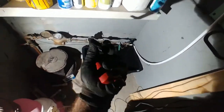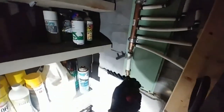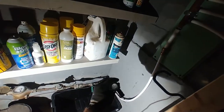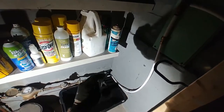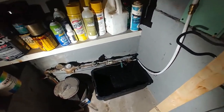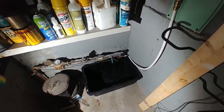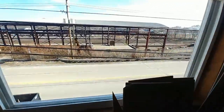flow through here so that it's 3/4 all the way and with 1/2-inch takeoffs, but in whatever orientation here, if he so chooses to keep going with 3/4 and go somewhere like the far end of the property and break it out again for another bathroom or like a nice big hose for a greenhouse or something, have a nice big diameter. You got pretty good municipal pressure here, so talked to my dad about this and he said it wouldn't hurt, so we're just going to throw this together while we're right here, and it'll clean up this room a little bit, so we'll look at that in a minute.